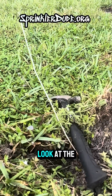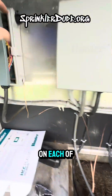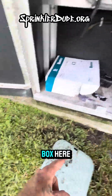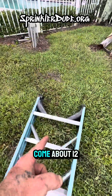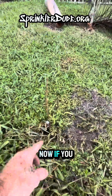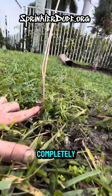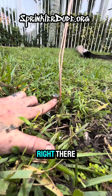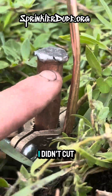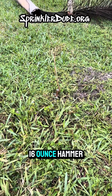Let's take a look at the finished product here. We've got one ground wire going to the ground lug on each of the two controllers here. They come out of the controller box, go underground, and come about 12 feet away — a little more than 10 — to this point here. Now, if you look at the top of this ground rod, you can tell it hasn't been mushroomed over completely, and you can actually see the two little lines right there. Those little lines are what's going to tell an inspector if you cut it or not. I didn't cut this ground rod — I definitely drove it into the ground with a 16 pound hammer.